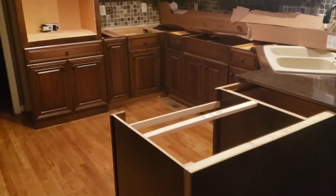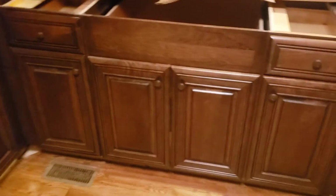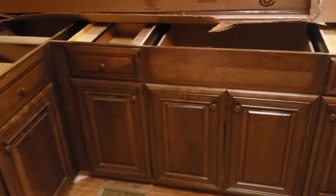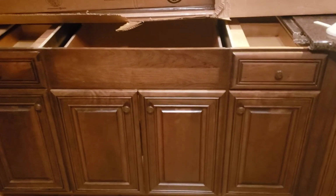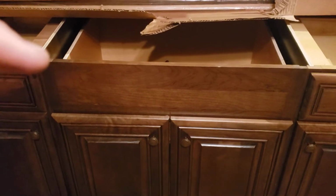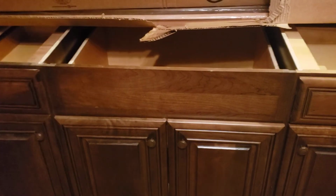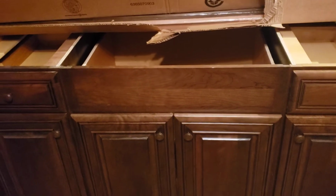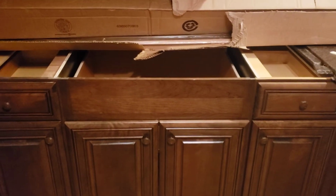Now, being we're talking about doors, take a look right here. This is a range base. If you see the doors on the left and the drawer fronts on the left and right, a range base is actually a cooktop base that the front of this was supposed to be cut out across, and a cooktop comes through the front of it. That's one thing it could be. There's several applications, but range bases do not have a drawer front on the front of them.